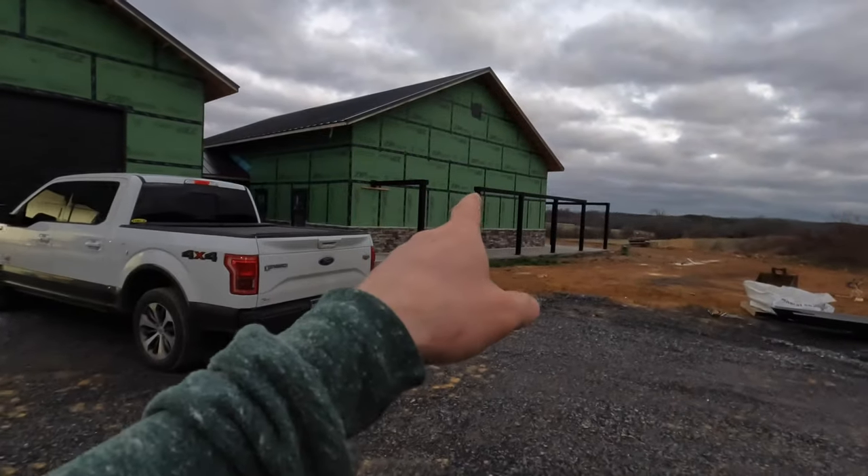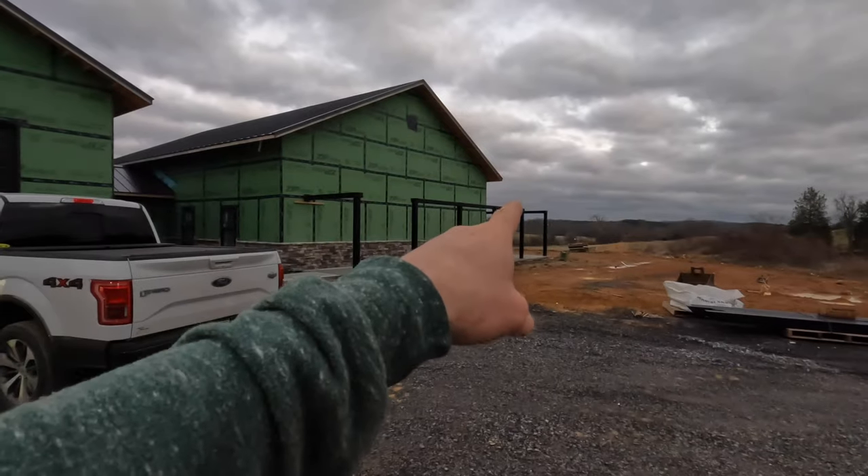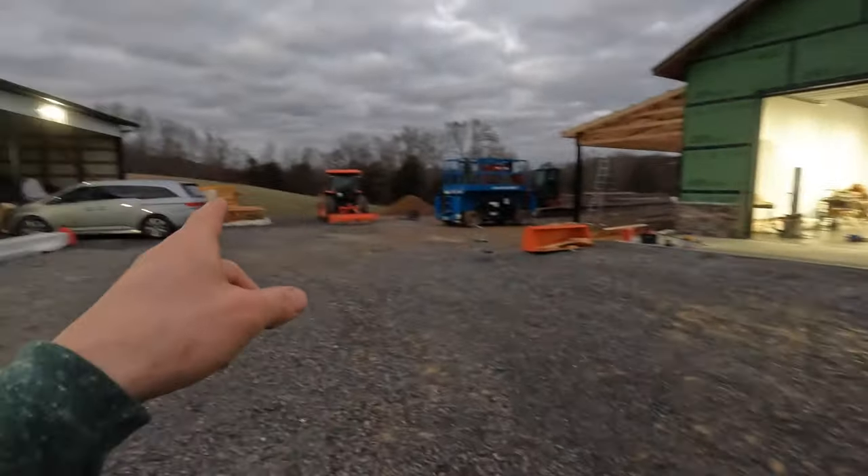Next up for me is I've got to build a porch to go around this house. I still have a few steel headers to put in, then I'll be putting in four-by-six wood rafters and a tongue-and-groove ceiling on top of it. Once I get that done, about all these big projects will be behind me. I still have to trim the house out inside and then we can get to painting and hopefully wrap this thing up before long. This little porch shed was a pretty big project for one person, but it actually was a pretty fun project. I'm glad it's done — once we get some metal on top of it we'll be ready to stick some stuff under it. If you watched this one, I appreciate it — until next time.